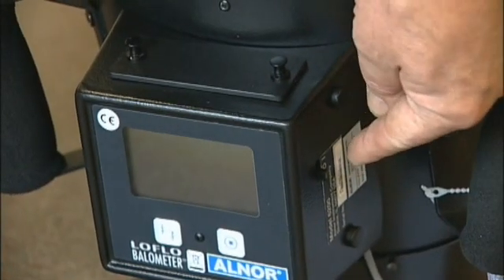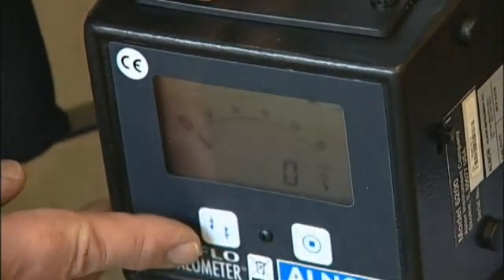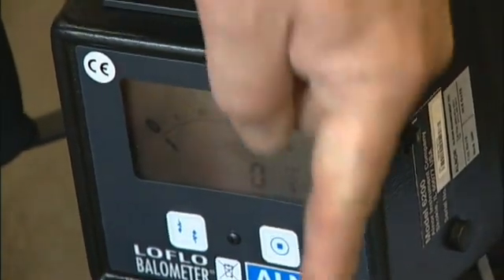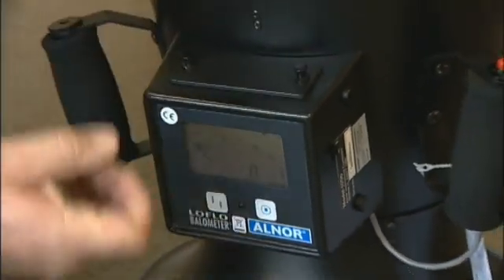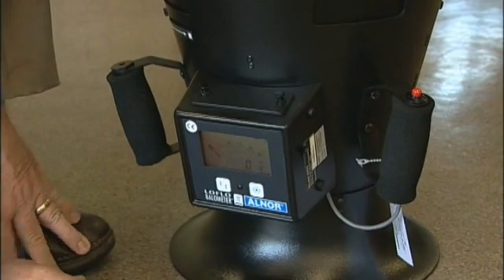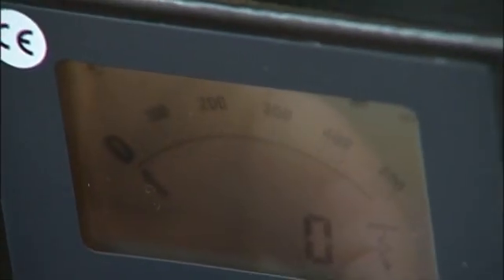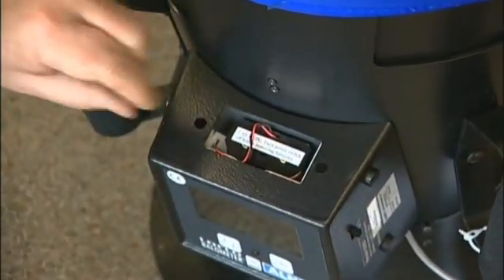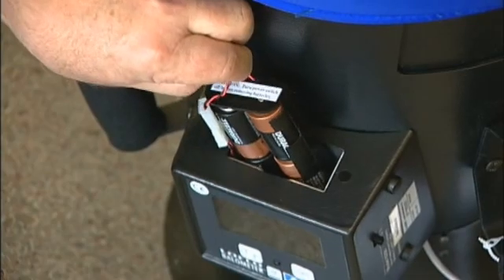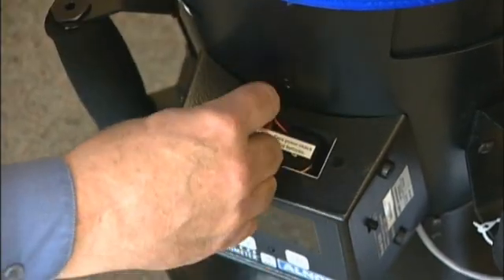The control device has a switch on the side and the screen shows flow rates. It has a control for the direction of airflow — you can change between supply and exhaust by pushing a button. A little arrow on the screen points up or down to indicate which direction the air is going. There are three scales for CFM and it will automatically pick the right scale, giving you both a digital and analog readout. This is powered by four C cells, so be careful to turn off the device so it doesn't wear out the batteries between uses.